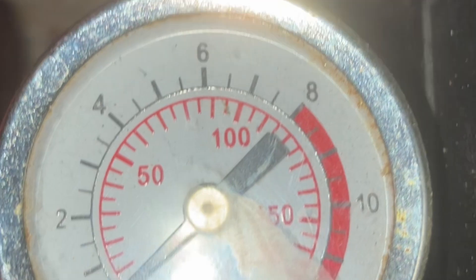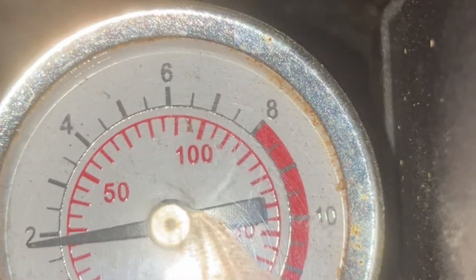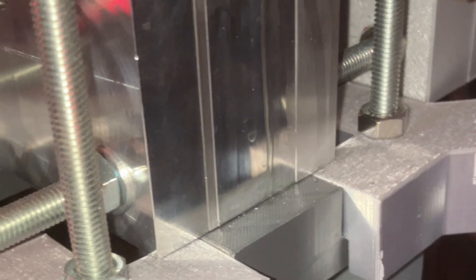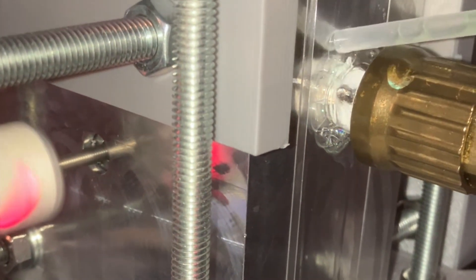For a small Tesla turbine there doesn't appear to be any off-the-shelf alternator or dynamos that I could use. A car alternator would be good except they aren't available small enough for me, and they won't be able to handle the RPM without a reducing gearbox. I'm expecting ultimately to go well above 18,000 RPM. Everything that I see that is small enough has permanent magnets, which would make getting a start from 0 RPM very difficult without using some sort of clutch or fluid coupling.